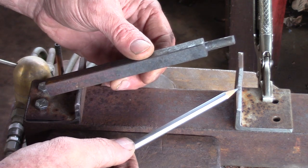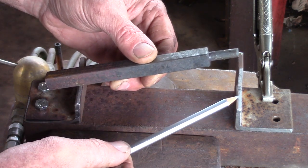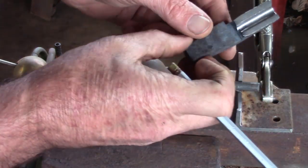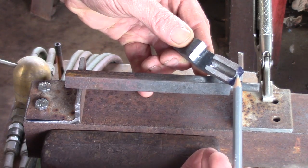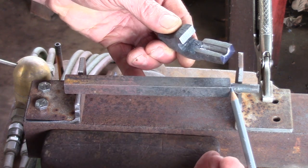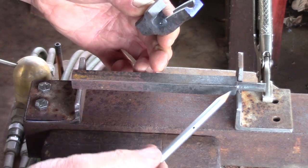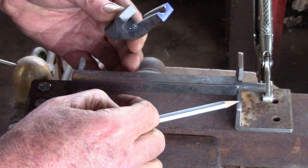When I look at the gauge, this gauge has got a chamfer, and that chamfer is the same size and shape as the root of my tenon. Remember, when we look at a monkey tool — a monkey tool has a chamfer to the inside, which gives a chamfer to the inside of the root of the tenon, so there's no stress riser. I need this shoulder to sit up against this angle iron without interference, so you've got to relieve that edge.